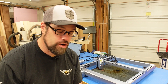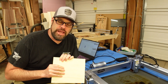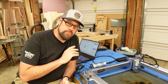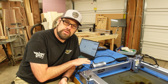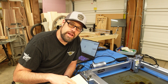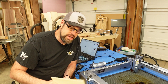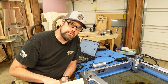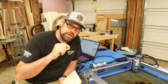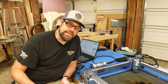Now let's test some features — a cut and engrave, testing the air on/off control. I have quarter-inch sanded plywood set up with a file that engraves my logo and the IKEA logo, then switches to a cut. I'll use auto air on both — low airflow during the engrave, then full for the cut. The engrave will run at 28,000 millimeters per minute at 100% power. The cut will run at about 400 millimeters per minute, single pass, with the Z-axis dropping 0.1 inch — roughly half the material thickness — to center the focus point.